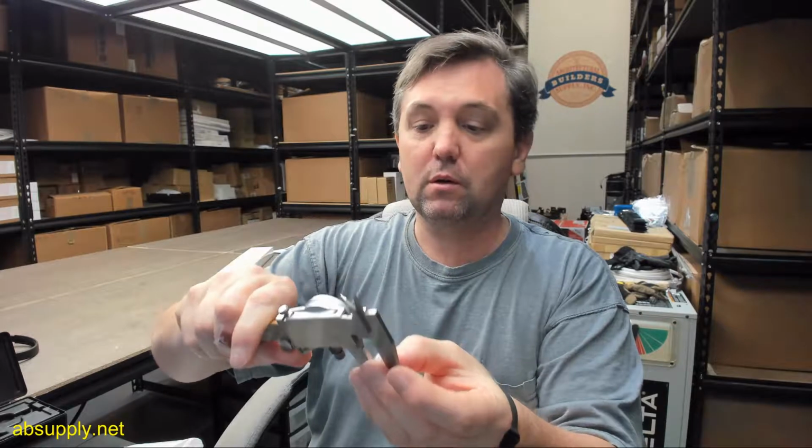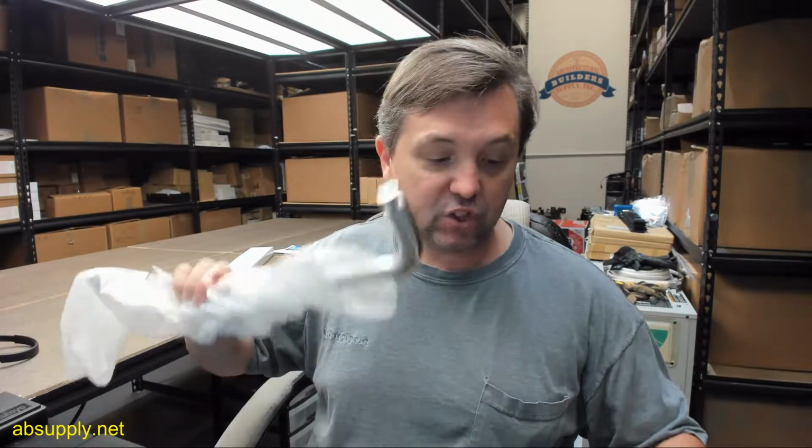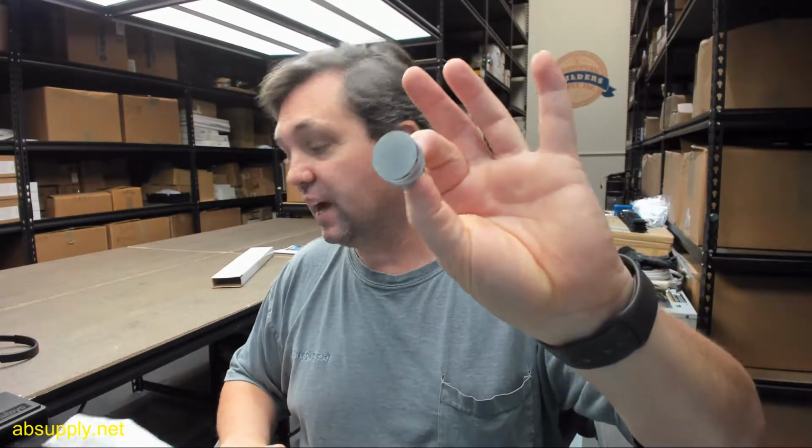It's intended for a half-inch hole, and the OD of this bushing is 0.43, so basically 7/16. Okay, so do keep that in mind. Could you make it work if you had a hole that was abnormally large? You could. So the cap is basically 1 inch. It requires a half-inch hole. If you've gotten larger than half-inch, but certainly below 1 inch, you'd be able to salvage the installation by using a pair of these decorative washer caps. Okay, but they are attractive. They are awfully nice looking and will make it look a little bit nicer.